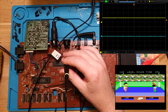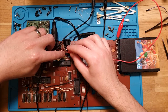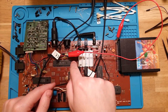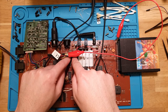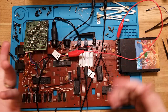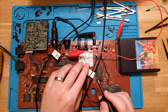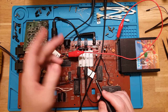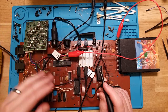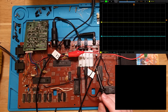Yes, that's also 2 volts. So if we ram this in there, that will effectively bypass the 4.7K and give it a better path to 5 volts. Unless it's a dead short to ground, which it's not because we're getting 2 volts through it, it should actually just be 5 volts now instead of 2 volts. And let's see what happens.